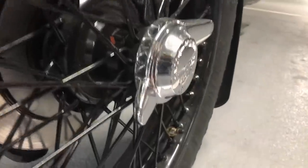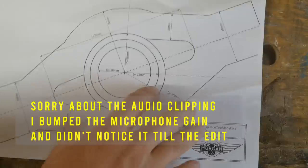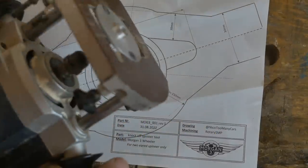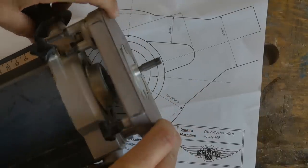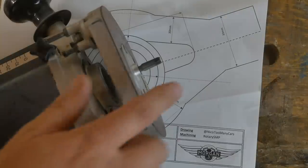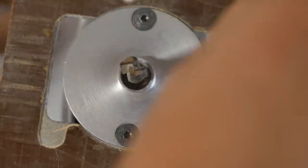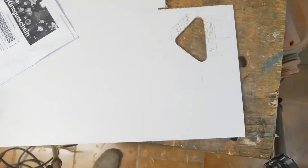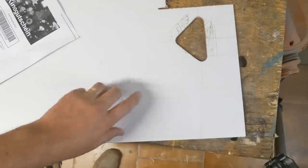A Mog wheel nut removal tool, otherwise known as a transmogrifier. Nikko drew a plan for me. The bit I need to rout out — because I'm going to use a router guide which is bigger than the router bit — I'm going to need to offset that by the difference in radius. 15mm guide, 10mm bit, so I need to offset that line 2.5mm. I'm going to be routing the template out of this 5mm coated fiberboard; I've used it for this sort of thing before.